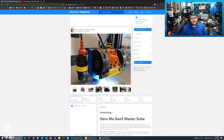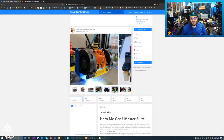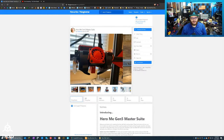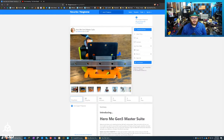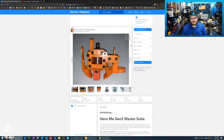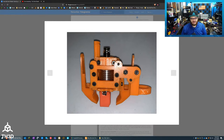In my opinion you don't need dual 5015 fans, but people like to do that. The only thing I like about dual setups is the ability to have an LED light bar, which is an option. I don't use dual setups because I haven't found them to be that much better unless you're using a really big diameter nozzle and printing fast. Here's an example of the Tough hot end with the Volcano-style block — one of the setups we're putting together with a single 5015 fan.